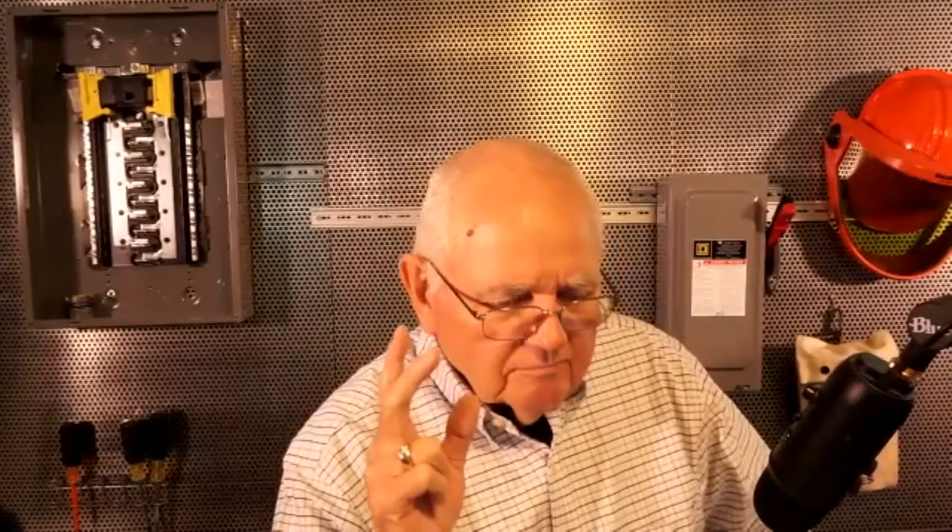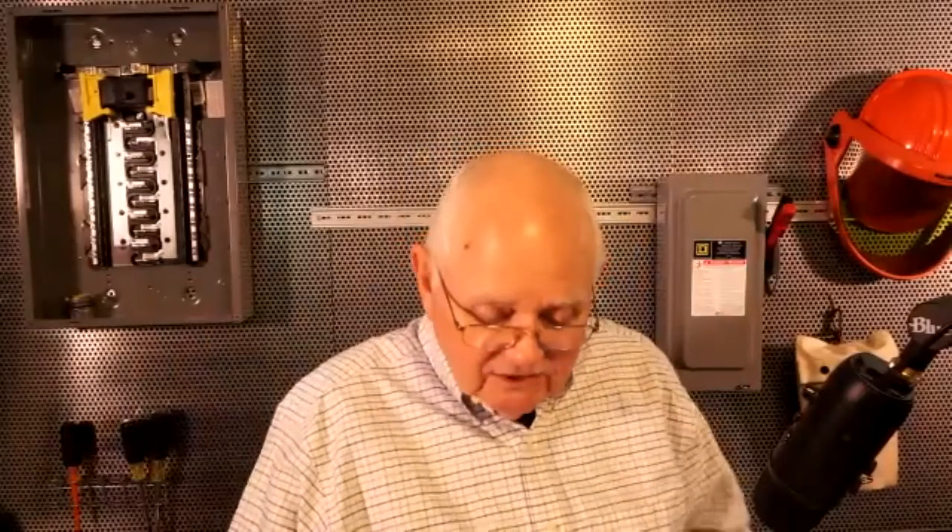So I can't splice it. However, you better read that section because it also references some other sections. Think about it — if I need to bond to a water pipe, and I'm going to use my water pipe as my grounding electrode because it meets the requirements of Article 250 for being part of my grounding electrode system, I'm going to connect to it in my house or building. So I've terminated that grounding electrode conductor and connected it to a piece of water pipe that extends out to my grounding electrode system. I am allowed to do that.